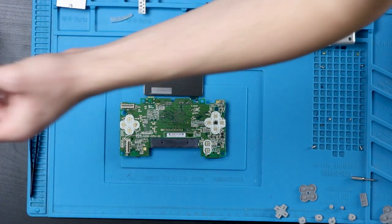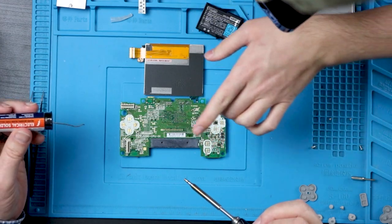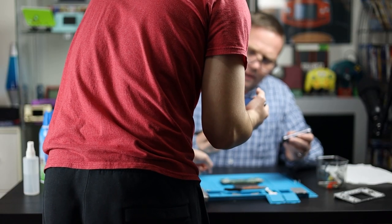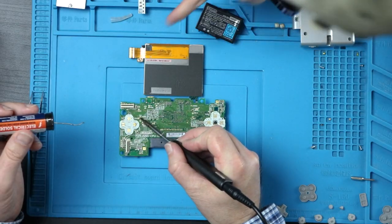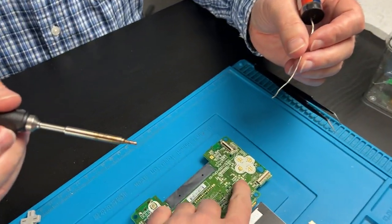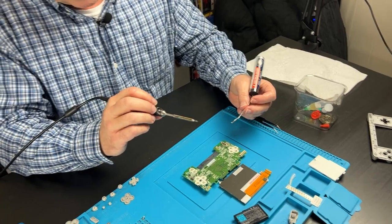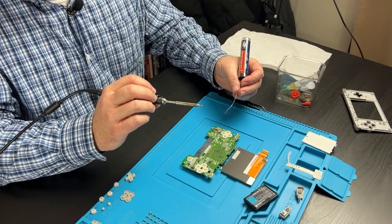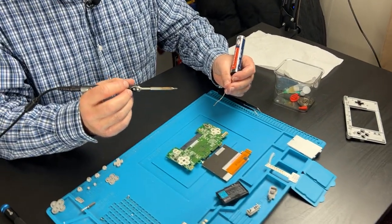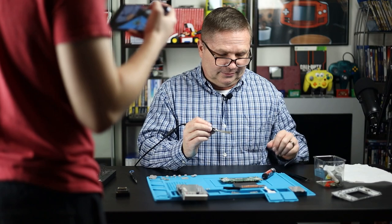The first thing to start — we're going to grab the solder. What we're going to do is put this, since it's not on, put it up to the point. Actually press down on it. Just push the tip. You can look for a second. Push it up there, and then what you're going to do is touch it. But you're going to want to grab the solder there, because you want to heat it up a little bit on the pad. You'll heat it, and then you'll push the solder into it so it just melts immediately. I see it's working because it's steaming a little bit. Yeah, I can smell it. It smells great. Do not touch anything silver from here on out — except you can touch the solder. But go ahead when you're ready.